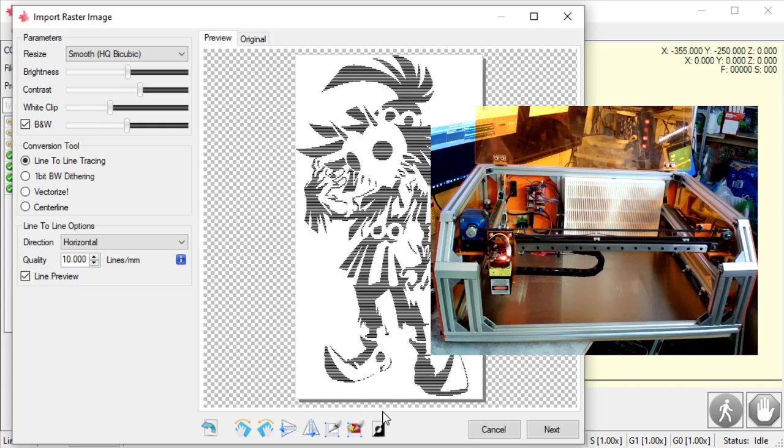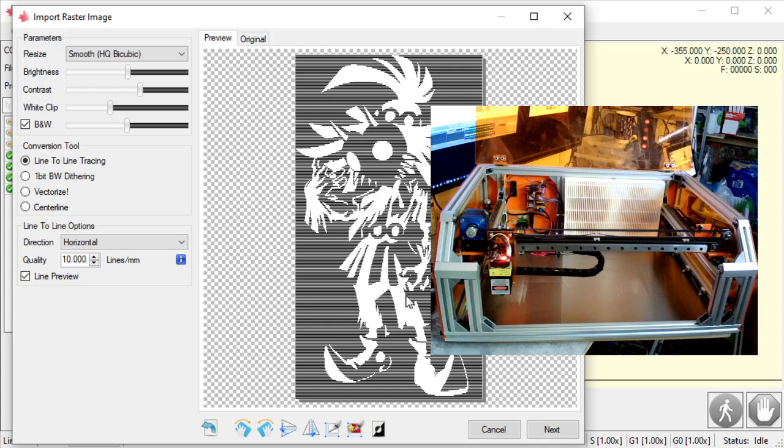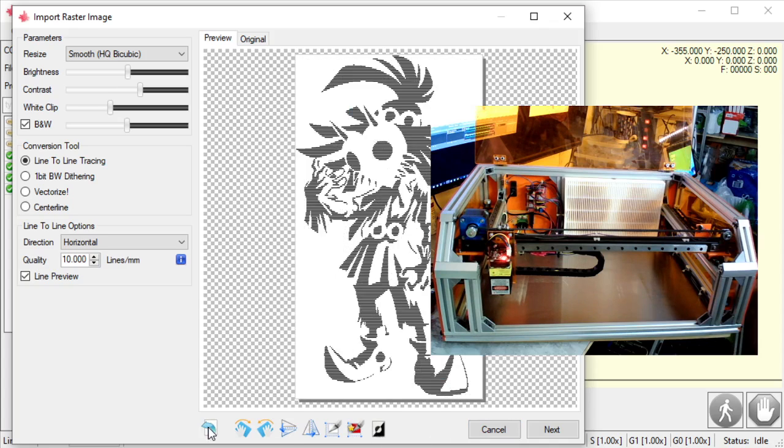Now, if I'm doing something like a granite slab and I'm engraving on top of it, when you engrave granite, it oxidizes the surface, making it lighter, not darker. So if I'm engraving wood, it's charring the wood, right? That wood is now darker where the laser hit. When it hits granite, it gets lighter. So really, granite starts out dark, and you're lasering the light spots. If you're doing that, this tool right here is perfect. It's called Invert Color. So now, it's going to engrave everything but what needs to be left. Anyways, I'm going to undo all this stuff.